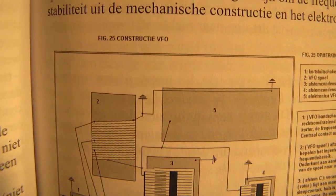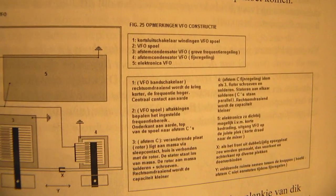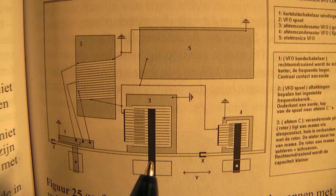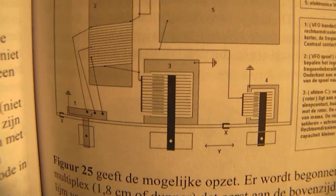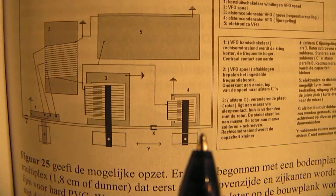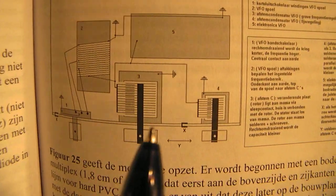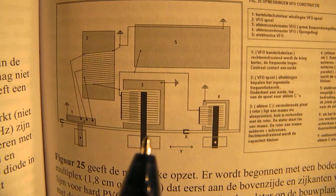Here you can see how you can make that. It's a quite small drawing but I hope I can explain it. Here is the main coarse variable capacitor that sets the frequency — the base frequency. Parallel to that coarse tuning capacitor there is a small, tiny fine tuning capacitor that goes from about 1 picofarad up to 50 picofarads, paralleled to the coarse tuning capacitor which goes from about 10 picofarads up to 200 picofarads for shortwave.